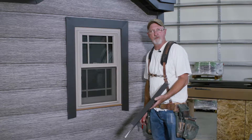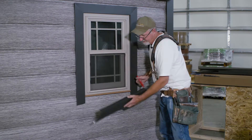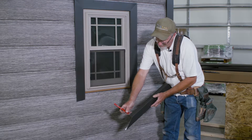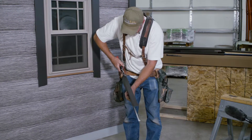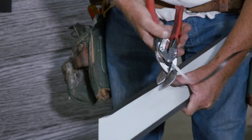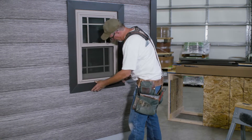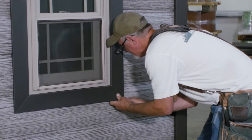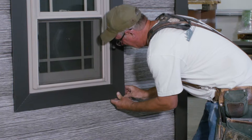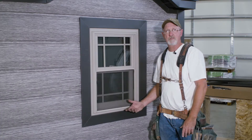Here's a little tip while installing your window trim. If it seems to be bending outward, not quite square, what you want to do is figure out the distance that you need to cut. Mark the leg, which might be too long. Take your tin snips, go ahead and cut that leg to shorten it up. Install your piece, and if it's square you have it. If it's not quite square, you can pull it out and cut a little bit more off. And that's how you install the bold window trim.